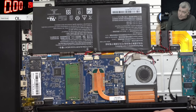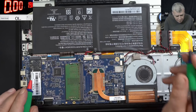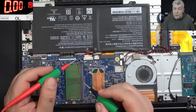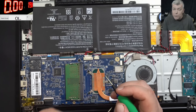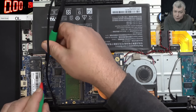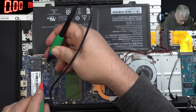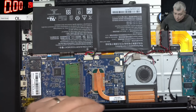Not this time — that's a surprise for me. Why? It's reading 1.4 ohms. What happened is exactly what happened on the last video with the laptop where I checked the fuse — there were two fuses supposed to be faulty, but actually only one fuse was faulty. The other fuse was probably good but my multimeter is playing up. I ordered another set of probes. Check here, it's not beeping... now it's beeping. So my probes are playing up, but I ordered another set for the multimeter. We have to remove the SSD.